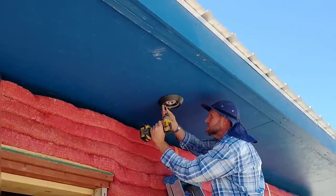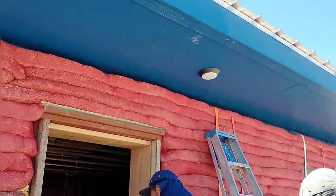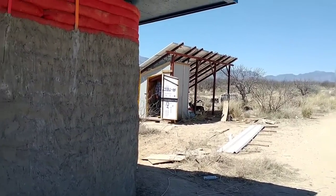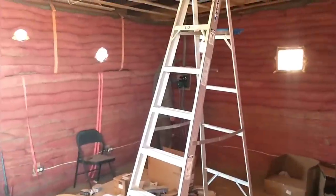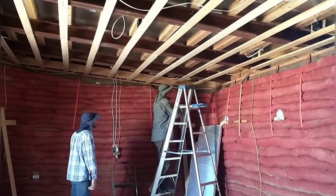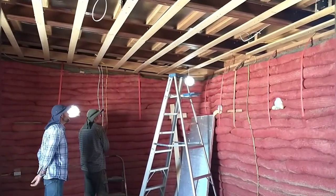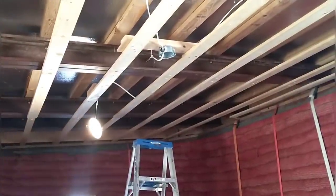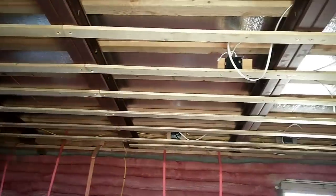Everything is pretty much finished up inside. I just need to install this porch light and we should be ready to do some test runs. We installed a light that points down and is shielded so that it meets the requirements for dark night sky lighting — we try to protect our dark night skies here in Arizona. We're now ready to double-check some connections in the solar shed. Kyle is completely on solar here — there's no grid connection on the property whatsoever. Kyle's already been using his solar system for over a year and a half to run his RV, so it's nice to finally get it hooked up to his home. Everything checked out good and we're testing out a light over the shower. Kyle wanted most of his lights to have a dimmer function, so we're testing that out as well. Kyle is using mostly recessed LED lights, with the exception of a ceiling fan over the living room/bedroom area.